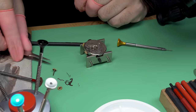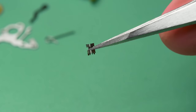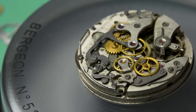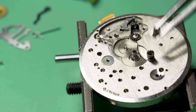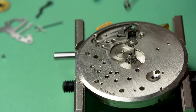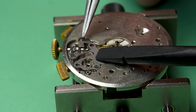If you've noticed here, I'm missing a screw. And as I mentioned before — take a look at this — do you see how it's damaged? Some of those teeth have been worn off or shorn off. So enter the donor movement. I found this one on eBay, made an offer, and the guy accepted it. So I've got at least two parts here that I need to replace, and who knows if I need to do more. I'll hang on to the rest of the parts in case I work on this type of movement again — which I plan on doing. I love chronographs.